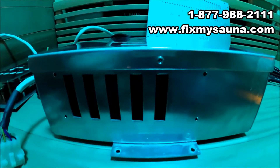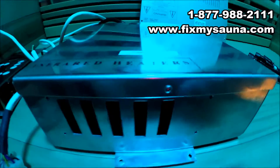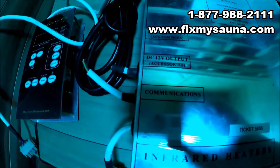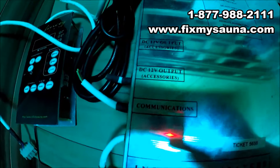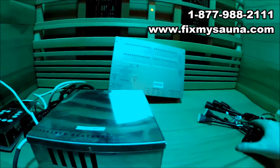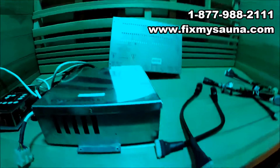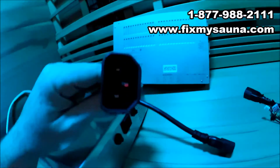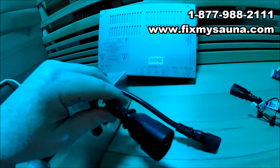What we do in cases like this is we start pulling your connectors, because these are usually proprietary connectors. So we pulled the heater connectors off of this old box, then we pulled your DC 12-volt output connector and your accessory connector. Then the technician wires your old connectors to our new connectors that go to our custom box.